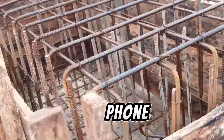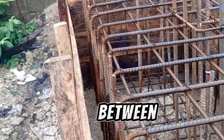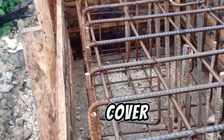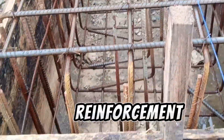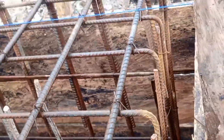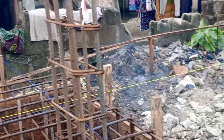There's something I want to show you here in the formwork. You see there's a gap between the formwork and the reinforcement — that is what is called the concrete cover at both sides. That is the concrete cover for the reinforcement. You don't just do the reinforcement flush with the same side as the formwork — there's space surrounding it, between the formwork and the reinforcement. That is what's called concrete cover.